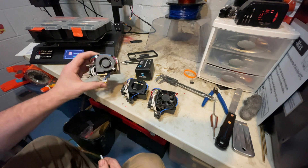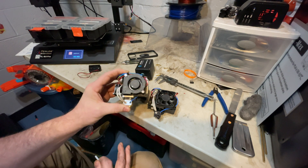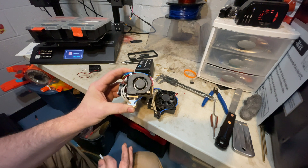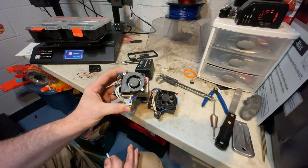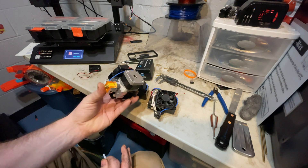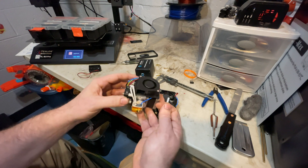With the low-temp extruder, all I'm using this printer for is TPU. I would suggest trying to keep your temperatures below 235°C and you should not have issues. I haven't had any issues since doing that, so I haven't even had to use the new extruder they sent me.